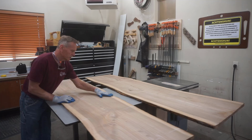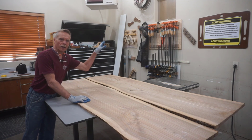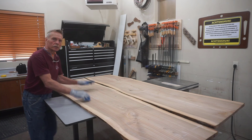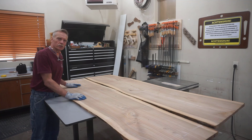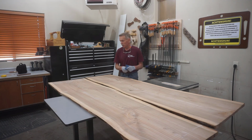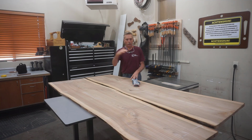And job one is to make sure the orientation marks I put on these pieces on the job site line up here so that everything is in the right position to do the joint. And if I were doing a more typical live edge joinery project, I'd start by making a pattern with whatever sort of wave I wanted in it. But because I'm working with these two particular slabs, I need to start the pattern off the contour of the wood and not make the joint the contour of the pattern.